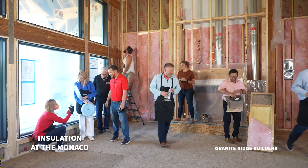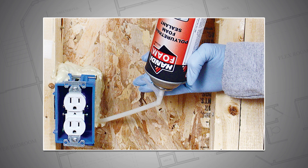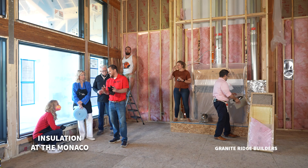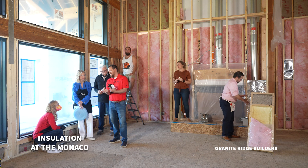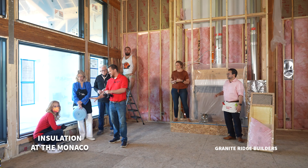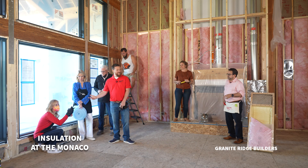Charity, you've got a spray foam can too — what are you working on? Just like Lonnie, I'm going around all the electrical outlets. Electrical outlets on an exterior wall limit how much insulation we can get around there. So you're making sure we've got the most amount we can get around there to make sure that wall — especially that weak spot where the electrical outlet is — will be well insulated. There are a lot of outlets.